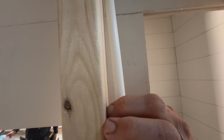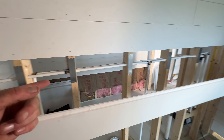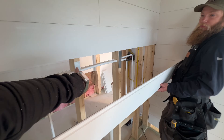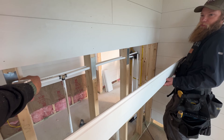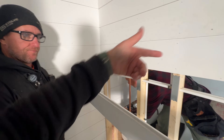I can't get it out. No nails. Pro tip — when I'm shooting these I am angling my nail that way just in case. Right at the pipe? No, away from the pipe. In case it was to shank off a little bit, I don't want to go into the plumbing pipe. A little bit of a problem on this board — the entire nailing surface where we're gonna put it is these plates that protect the plumbing, which is great. Required by code, but we're just gonna have to shoot this only on the ends and then it'll get held top and bottom by the boards above and below it.